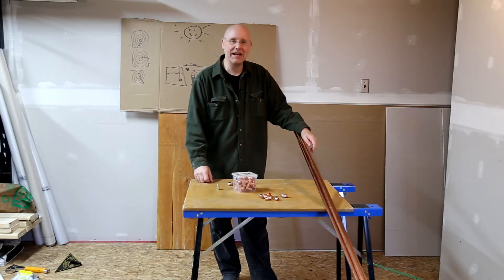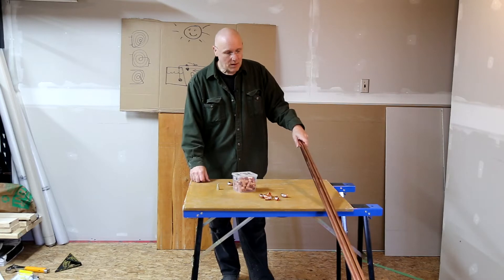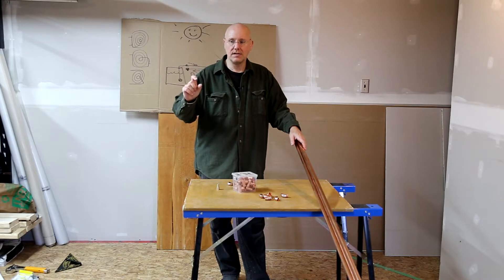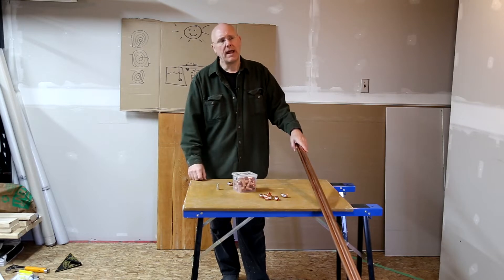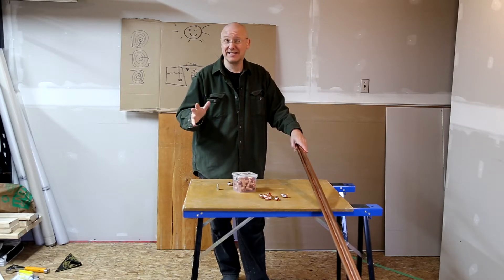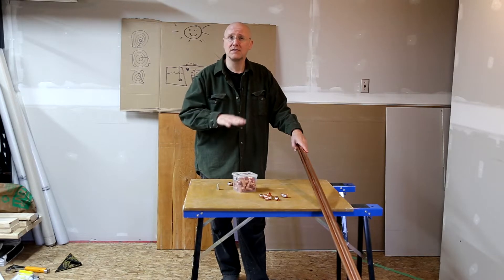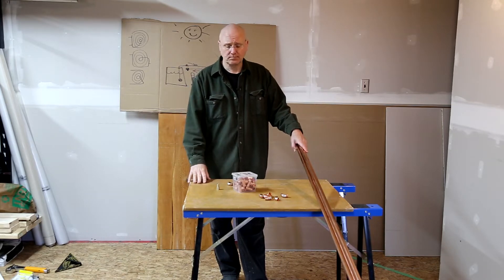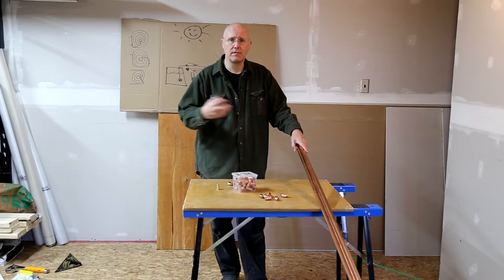We're making a solar thermal heater that will hopefully heat up this workshop. In the last episode, I talked about how I had my one-inch vinyl tubing in the box and I just didn't feel like it was transferring the heat from the box to the vinyl inside. I was getting about 72 degrees Celsius in the box but about 20 degrees less than that in the vinyl tube, so I didn't even hook it up or pump water through it yet.